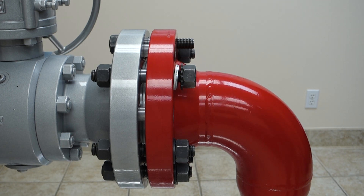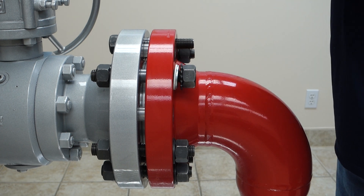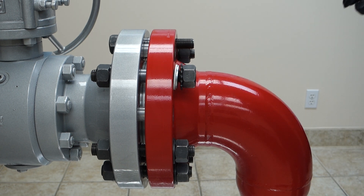This is just a short video to show the benefits of the high torque washer when used in conjunction with an insulating kit. With conventional torque — a reaction arm tool — there's a great amount of side load applied to the bolt during the tightening process. This tends to crack insulators quite often.